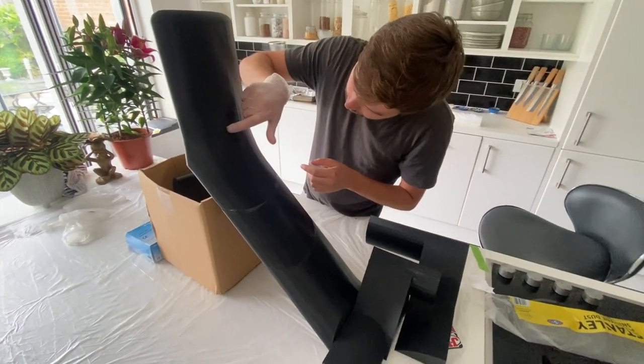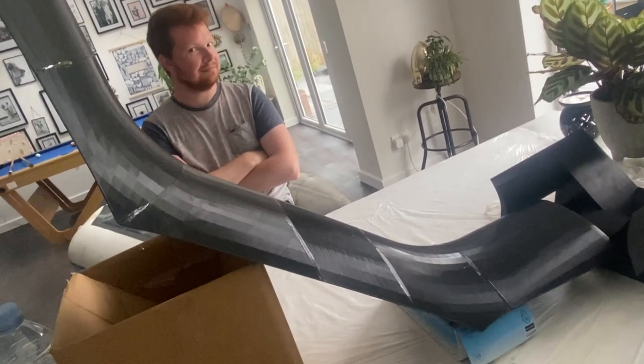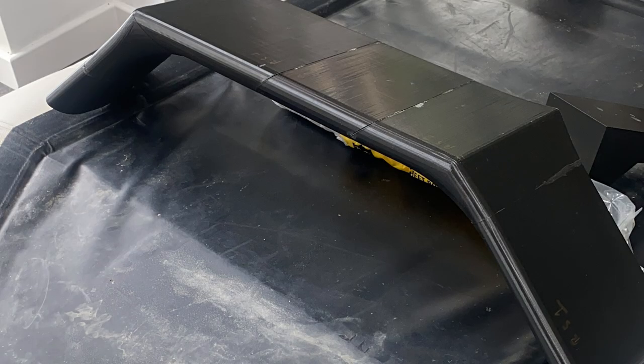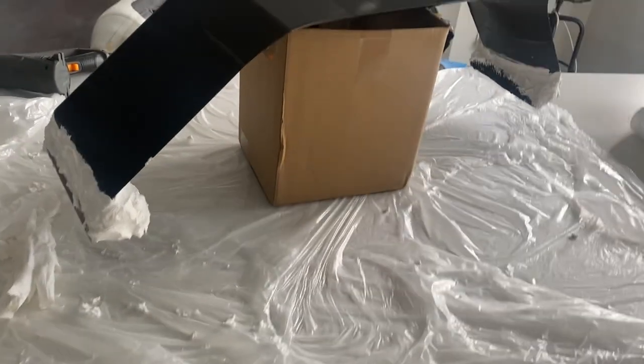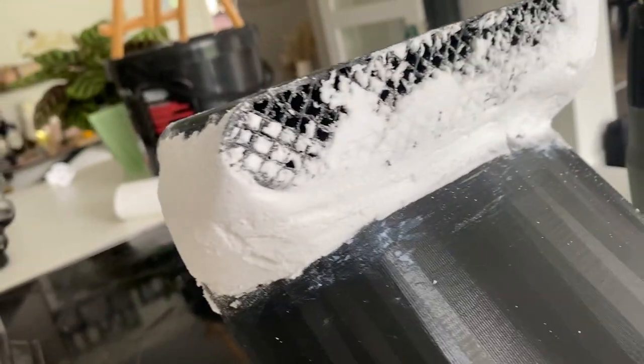Even with Tom's optimism, it was pretty clear — the foil was far too big. To get an engine anywhere near that sort of length would be huge. This wasn't going to work. It's time for Plan Bravo, or should I say Plan Bodge. For all you perfectionists out there, look away now — this isn't going to be pretty. The hydrofoil leg was so big I could use it as a single wing across the centre of the boat, like I'd seen with other designs. I'd printed one part of the second leg, and here's where the bodge comes in: I chopped the section in half and crudely glued the parts to the main wing, then used filler to cover up the gaps. The theory being once I fiberglassed it, that would provide the strength required, even if it didn't look pretty. A quick sand down of the filler and the bodge was complete. I wasn't proud, but I think it will hold up once it's fiberglassed.